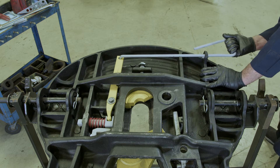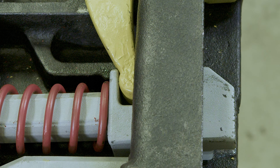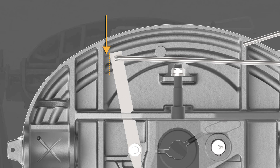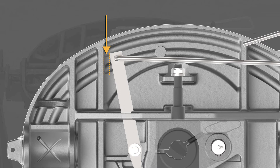Check the travel of the plunger. With the release handle in the closed position, the edge of the release lever should be a maximum of one-half inch from the top plate casting rib as seen here. If there is an issue, begin by checking that the rounded end of the release lever is not hitting the plunger guide rib of the casting. If the rounded end is hitting the rib, bend the rounded end of the release lever down so that it goes deeper into the plunger slot. If the release lever is still greater than one-half inch from the casting rib, remove the release lever and bend it until it is less than one-half inch from the casting. If the square end of the release lever and/or the end of the release handle is hitting the casting rib, grind the corner of the release lever and/or release handle until it is one-half inch clear of the casting rib.